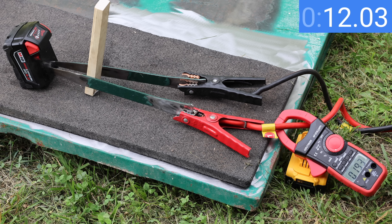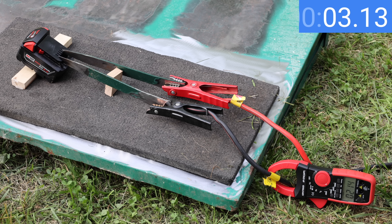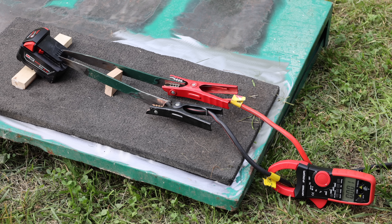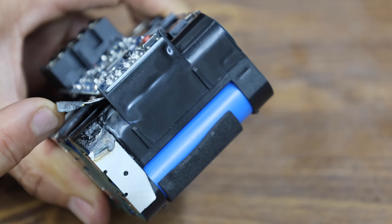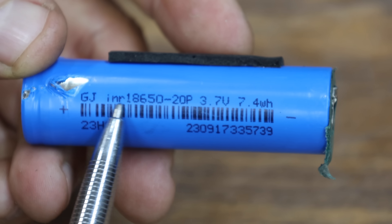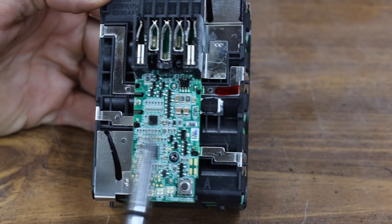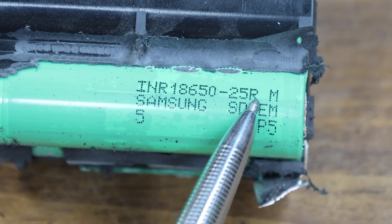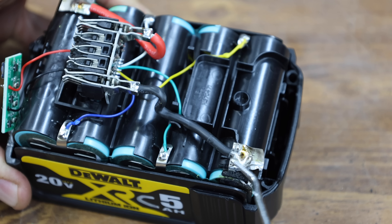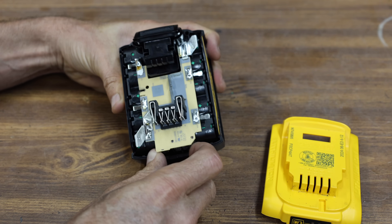A second genuine Milwaukee battery made it to 287 amps and also tried to power through the dead short for over 17 seconds — very surprising it didn't power down sooner. Unfortunately, both counterfeit Makita batteries are ruined from previous testing. Taking apart the batteries, the counterfeit Milwaukee has an interconnect designed to act as a fuse, and it did work as designed — but a genuine Milwaukee battery is supposed to have Samsung batteries, and this one is definitely not Samsung. The genuine Milwaukee showed no sign of internal damage, but the battery charger wouldn't charge it — the control board was the point of failure. The genuine Milwaukee does indeed use Samsung 25R cells. The counterfeit DeWalt's battery case had melted, but its interconnect also acted as a fuse — however, these are definitely not Samsung batteries in the counterfeit DeWalt. The genuine DeWalt also had an interconnect that acted as a fuse.